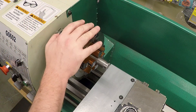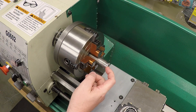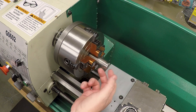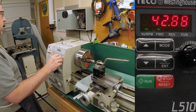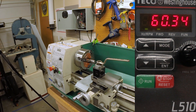Okay, I got the four-jaw chuck set up in the lathe, and I've got just a piece of about 12 inches of one-inch 1018 steel in here. This is a typical kind of piece that I turn — give it some mass. I've got the variable frequency drive set here to 60 hertz, which will be kind of normal 100% speed on the motor, and then let's take a look at what I have set for the acceleration and deceleration times.